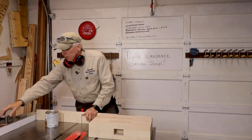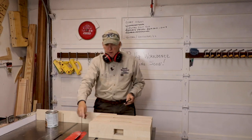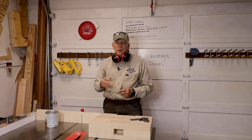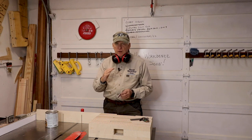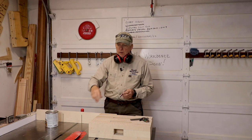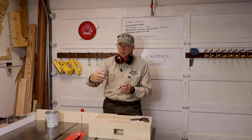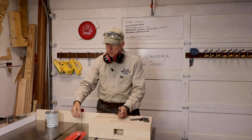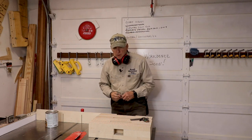There's many ways you can do it. What I've done is I've set my SawStop saw, and hopefully yours will do this as well, so that you can use your table saw for this function. If it's the first time you set it at 45 degrees, make sure you see if it clears your plate, because if you're off alignment and then you go 45 degrees, something's actually going to catch. So always check your blade by rotating it, making sure that there's no encumbrance.